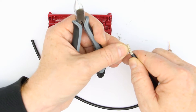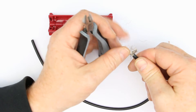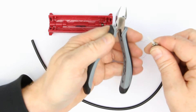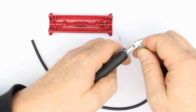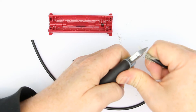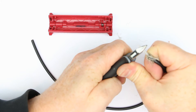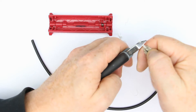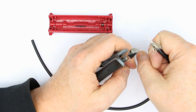If it's only a few wires it's okay, but if half of the grounding meshwork is cut through, that's not a good idea. And what's still more difficult is to get the insulation off the inner part of the coax cable, because you quite often cut through the central wires, or if you don't cut deep enough you don't get the insulation fully off. Anyway, that's not the best way.